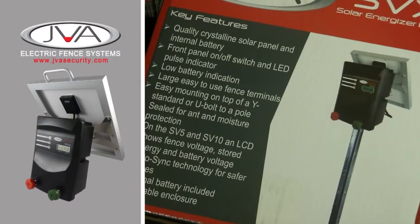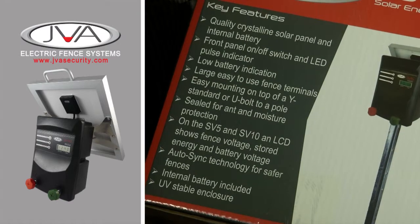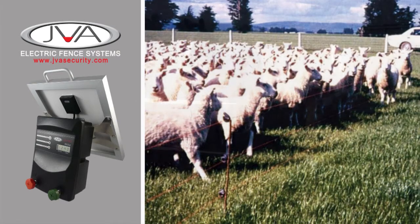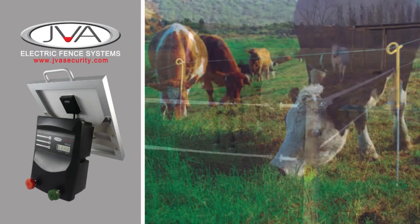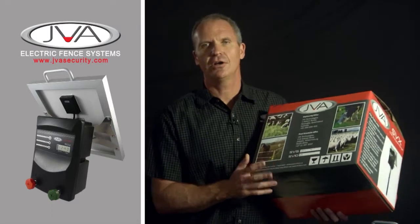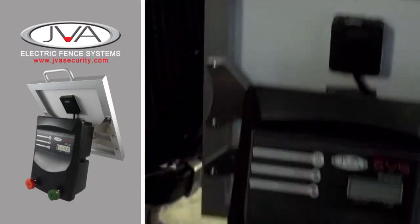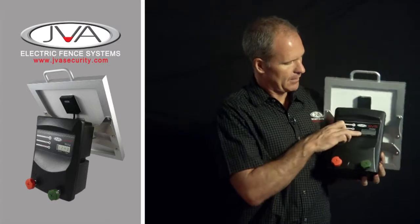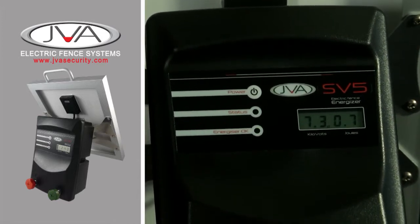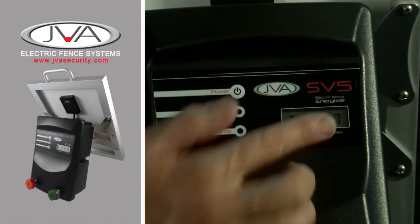The unit can be installed in a wire standard or a fence picket and knocked into the ground. Always remember to face your solar panel north. The energiser has multiple features and is great for all forms of strip grazing, temporary fencing and equestrian fencing — anywhere you need a fully portable unit, quick and easy to install. The winner for me is the LCD display. So often you're in the field and don't know if your energiser is working, but by looking at the LCD display, you can quickly see the voltage and joules on your fence. When I switch the energiser on, you can see it's pulsing — showing 7600 volts out and 0.7 joules stored energy on the fence.